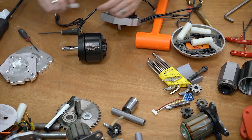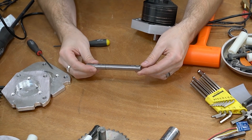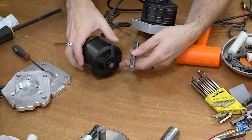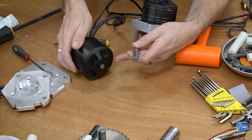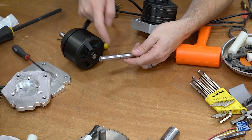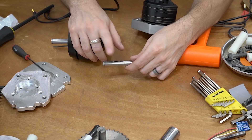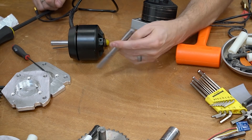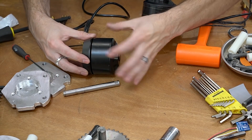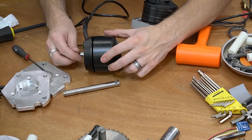Let me show you the old shaft and what we're doing with the brand new shaft. This one has a couple of flats on the back where the set screws attach. Then we have a little slot for a ring on the front so it doesn't come apart, and a couple of keyways — I added the secondary keyway. So there's nothing really preventing the can from loosening or wobbling around, and nothing to keep the shaft from spinning.